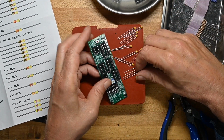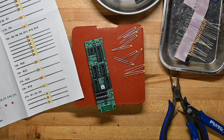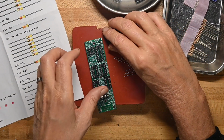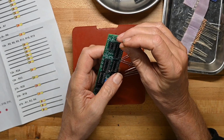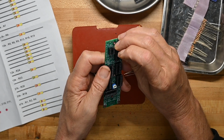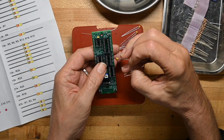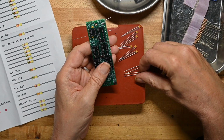So that's all the 104s and their decoupling caps to manage the power, smooth the power, clean up the power going to the ICs. So we will be looking around all the ICs to see where they go, and we should be able to find them right close to them all the time. And we'll start with C3. That's right next to the 555 timer. C4, and etc., etc. I'll speed this up.